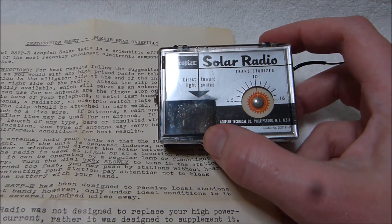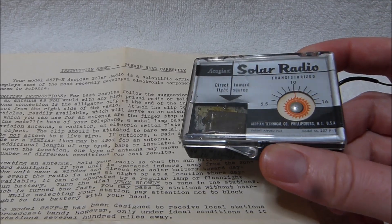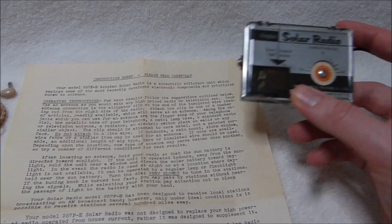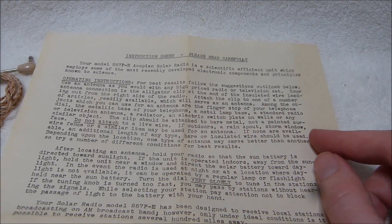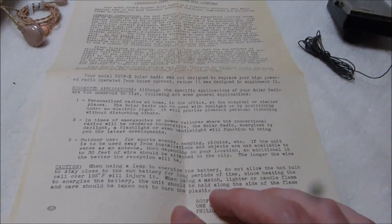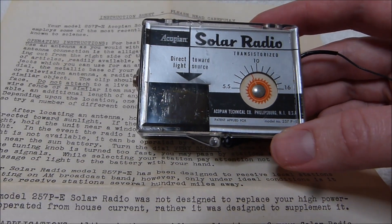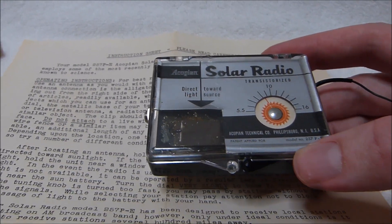Those are some bold claims, but the solar cell was very new at the time. I think if you were to show this to people from back then, they would be impressed that this thing is able to get its power from the sun. Nowadays, solar-powered calculators can be picked up at a dollar store, but that was not the case back then, and the solar cell was surely the most expensive part in here. They refer to this thing as an antenna, but some of the things they suggest connecting it to would be grounded, so I'm not really sure what the proper term is. They say you can run it on a regular lamp, flashlight, or potentially even a match or lighter, which seems very impractical. This thing really needs a strong light source to produce even the feeble amount of power it's capable of. I measure just half a volt, and I'd be surprised if the current is even over one milliamp — it's probably down in the microamps.